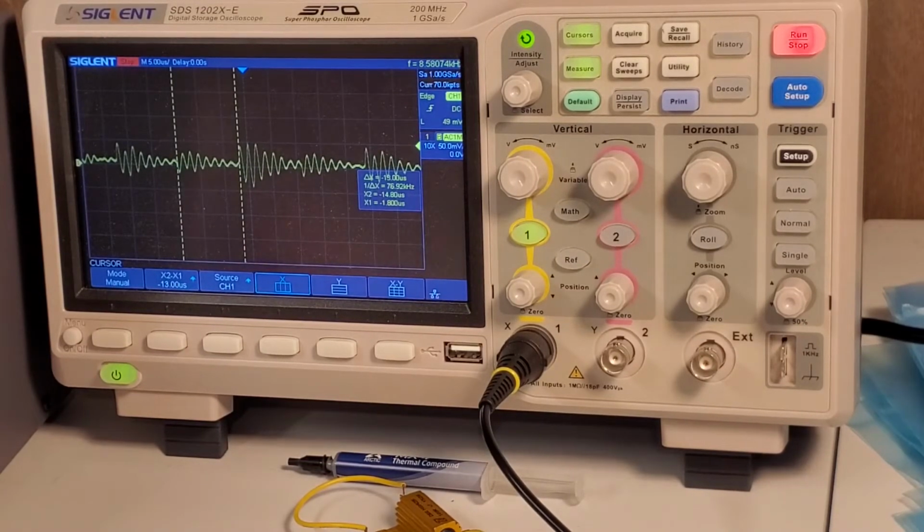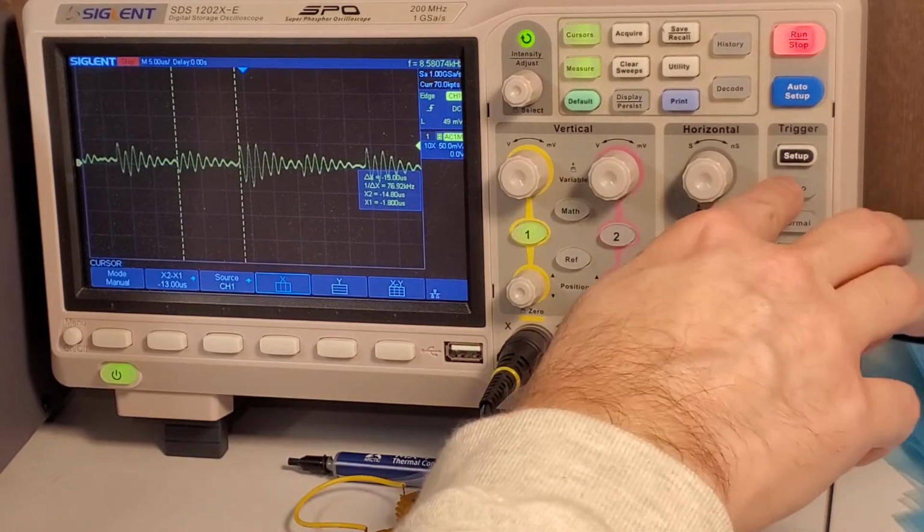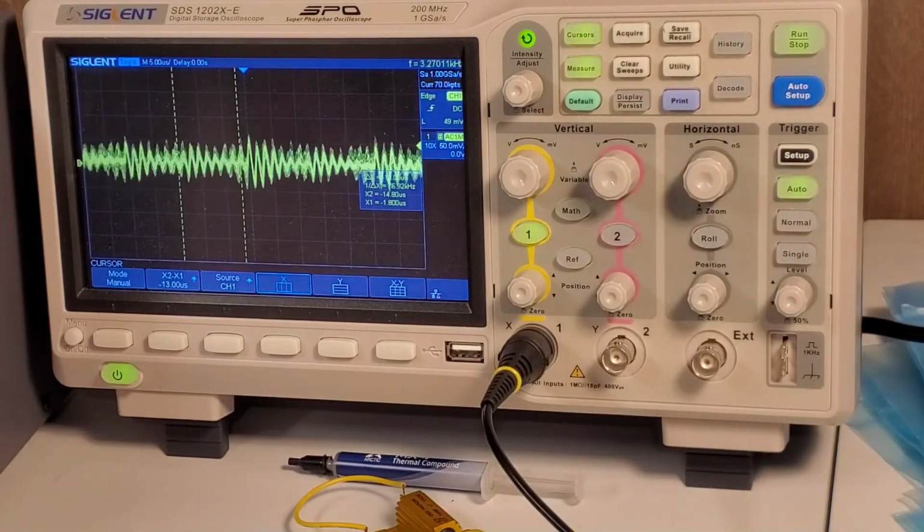in there. For power electronics that size, historically it used to be closer to 20 kilohertz, but nowadays 40 to 100 kilohertz is not crazy, especially if this is the offline switching noise that we're getting. Offline flybacks and stuff for this size of supply, if you were to design one today, you'd be somewhere between 50 to maybe 200 kilohertz. The frequency is slowly edging its way up over time, so there's some switching noise there, but not bad. It's in the 100 kilohertz region.